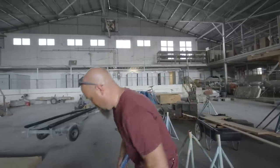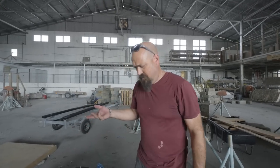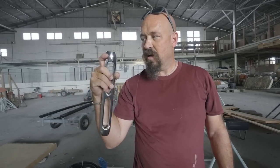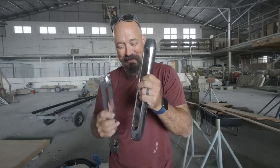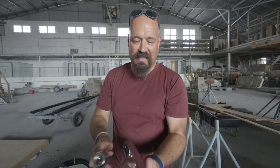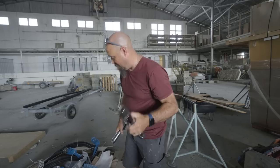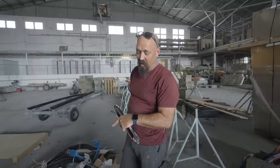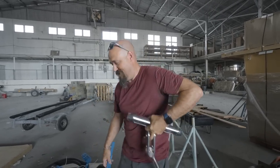I've got to show you this — it's insane, I'd call it comical. The 50 is a decent-sized boat, and this monster turnbuckle is as big as my forearm — it tensions the cap shrouds to hold the mast up. When you have a 22-millimeter hole, you have to go up to a bigger one. That thing has got to weigh eight to ten pounds of solid bronze. So we got the right stuff, but now everything is upsized on the mast — the hardware on the baby stays, the hardware on the big stuff. This isn't going anywhere.